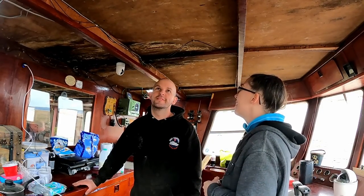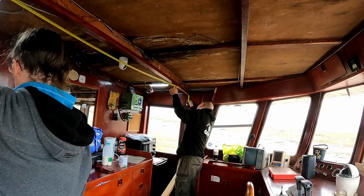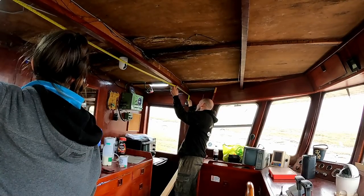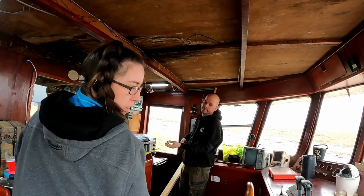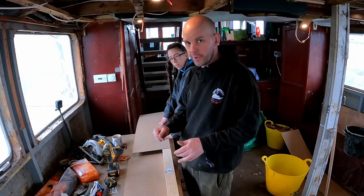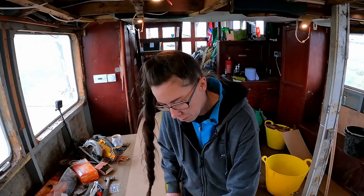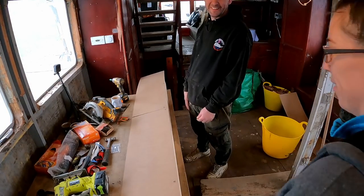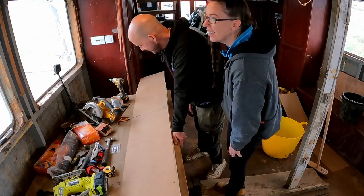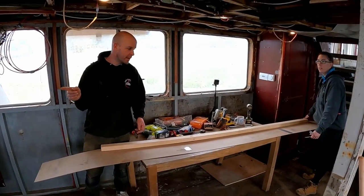So we're going to make a template that we can take back to the workshop and cut all our beams with the right curvature in before we bring them to the boat when we're doing the roof. Template time. So first we need to measure out the widest points — 3,370. We're going to use fibreboard as our template material — it's basically the protective layer that comes when you order posh furniture board. Looks like two mil up. Two mil is not a lot to us but to the bank it's quite a lot.